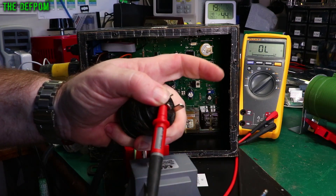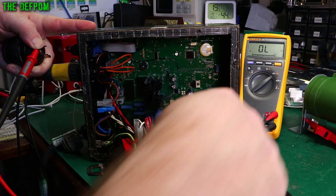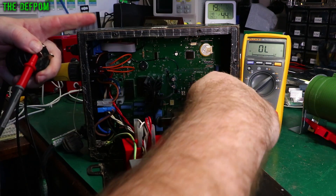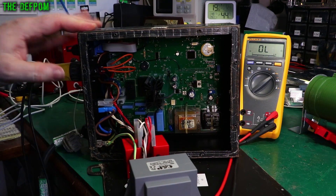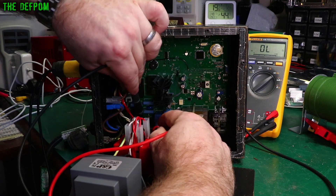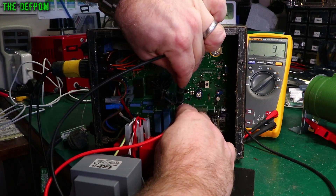Let's check - shorting across both ends of the plug for a quick test. Yes, the connection goes right through to the circuit board, so the switch is working. Turned the switch off, it shuts off cleanly too. Switch is working, it isn't a switch fault. There are two fuses on the board, so I'll check those next.